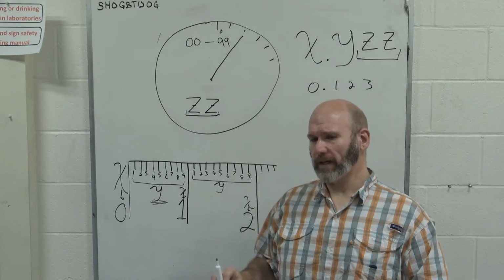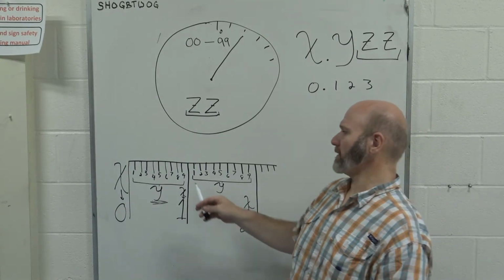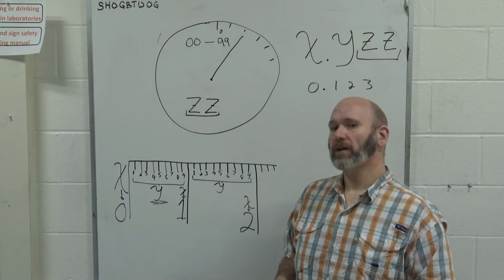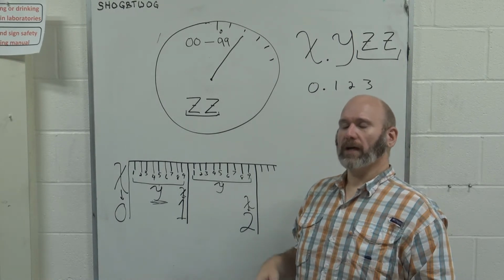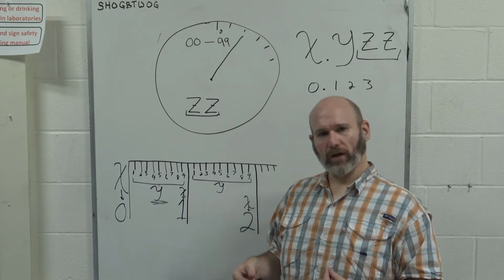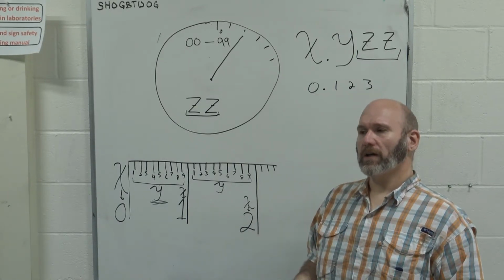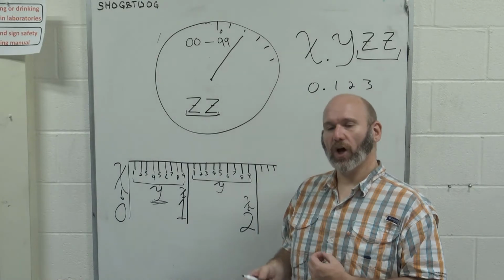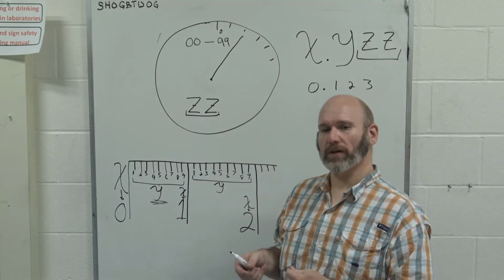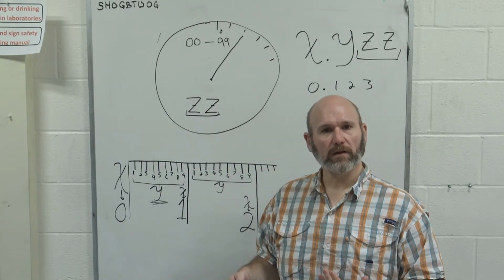So please be careful. This is where some practice with measuring things that are known values really comes into play. There's lots of stuff that you can measure, that you know the answer to. I would suggest opening your calipers to known values that you can compare to a scale.